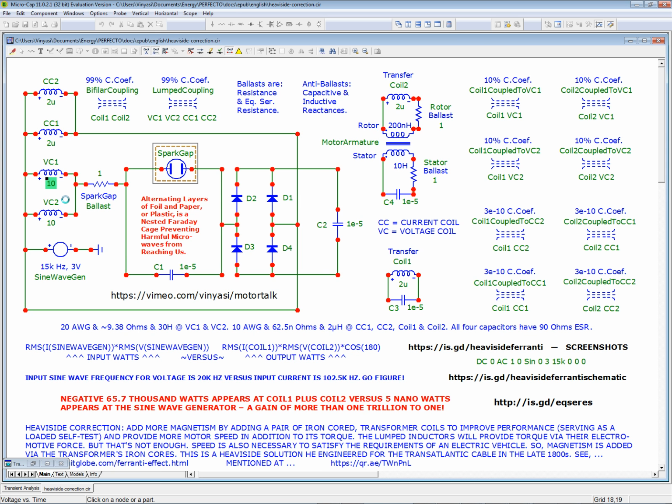And that's why I had to turn to lowering the frequency as a last resort. But actually, this is my first choice for lowering my wattage, is to lower the inductance on these coils. But only if I can get away with it. So, lowering the frequency helps me get away with it.